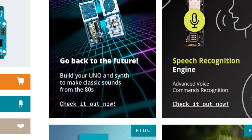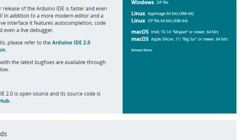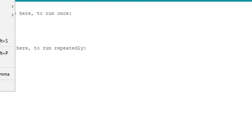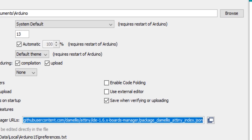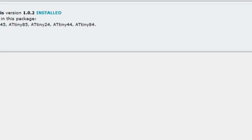First, install the Arduino IDE software. If you haven't already, download and install the Arduino IDE from the official website. I will place links below this video. Installing the ATtiny boards. Next, you need to add support for ATtiny boards in the Arduino IDE. To do this, go to File, Preferences, and in the Additional Boards Manager URLs field, add the following URL. I will also put this link in the description below. Install the ATtiny85 core. In the Arduino IDE, go to Tools, Board, Boards Manager, and search for ATtiny and install the ATtiny by David A. Mellis.